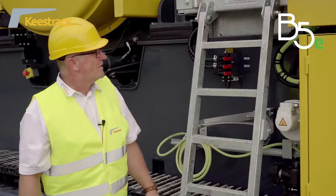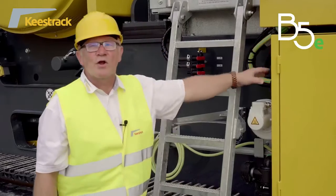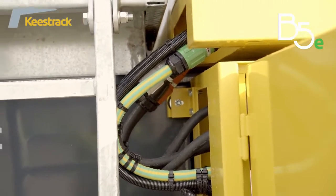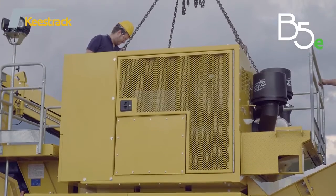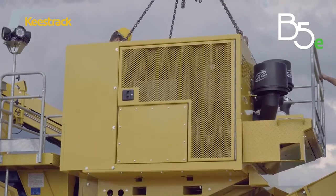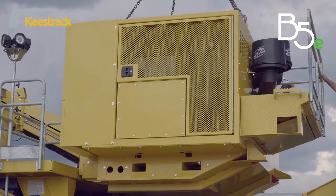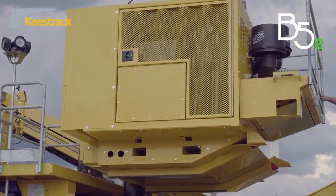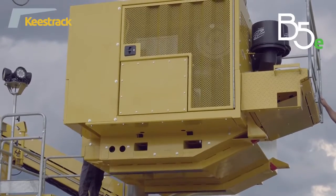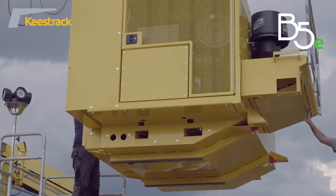So for drop off of the engine unit, we have here power lock connectors, which can be disassembled very fast. The engine unit can be removed, and with cables we can supply the power to the machine. Even if the engine unit has some service or some fault, you can rent a standard diesel genset and connect the power up to here, or you supply power from your grid.